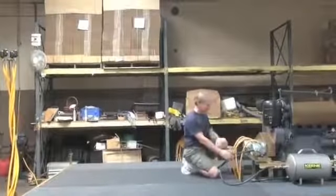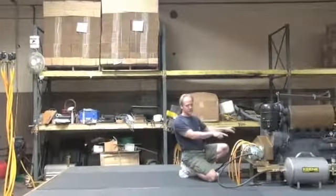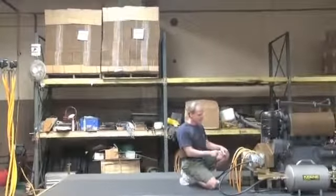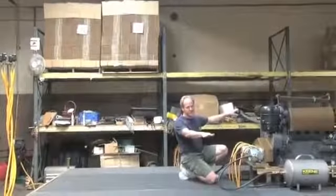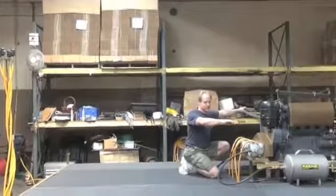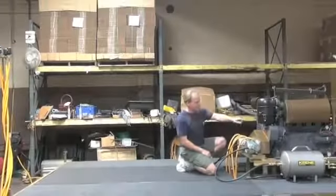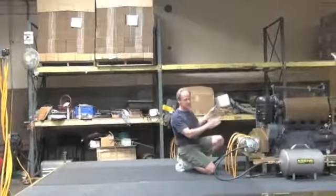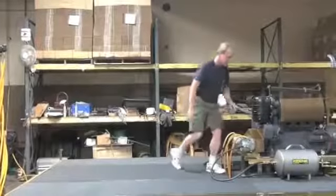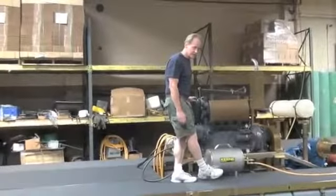We have two outputs for air. Each air compressor is driving two separate air tanks. Normally we just have one air tank, however with this particular unit we have two separate six-inch intake lines — we could have 100 feet of six-inch hose going this way and 100 feet going that way. We're putting two separate air systems, and on these we build a crossover tube as well, so they always have the same pressure. The air pressure is probably somewhere about 80 to 100 psi in the air reserve tank.